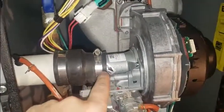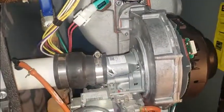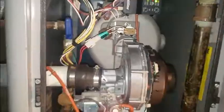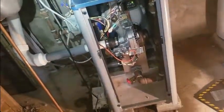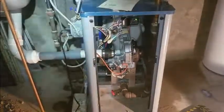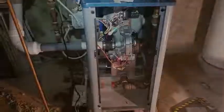Always check these bands — make sure they're nice and tight. Reconnect your wire, of course. Before you fire up, check all your hoses and make sure none of them got pulled off while you were working. Before you leave, do a combustion analysis and carbon monoxide check — always want to do that for everything you touch. Give us a call for any of your residential or commercial heating and air conditioning needs. Thank you very much and have a great day.